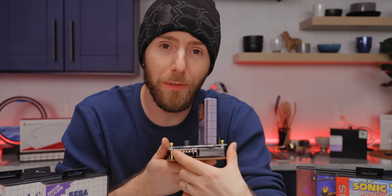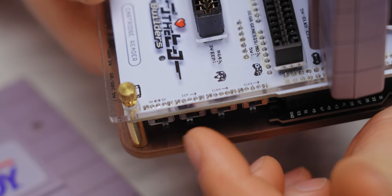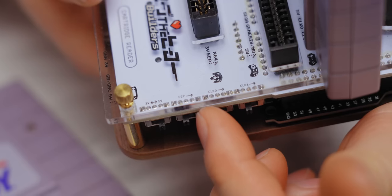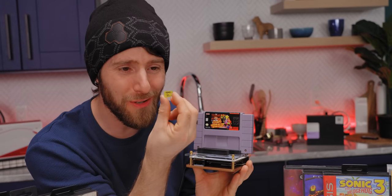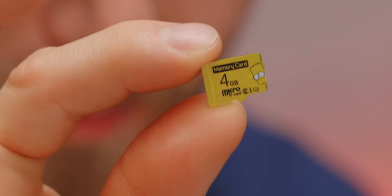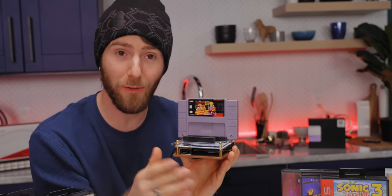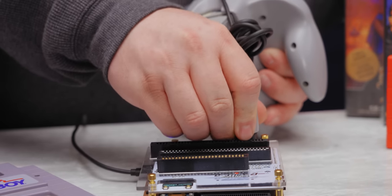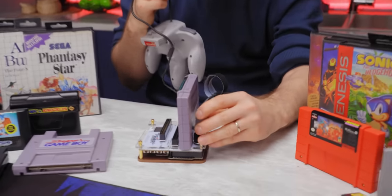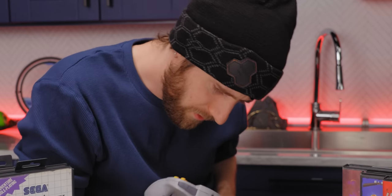These four switches here allow us to select between 3 and 5 volts — 5 is what we want for the Super Nintendo. EEPROM off or on, we want that off. And then both of our clock gens, 0 and 1, are going to go to the on position. Next, we're going to put this adorable little microSD card featuring Bart Simpson into our Save the Hero. This contains the database files that we need, which can be downloaded off of GitHub. Now we power it up. The controls are actually handled through the onboard buttons — is that the most adorable little power indication LED or not? Open source cart reader.